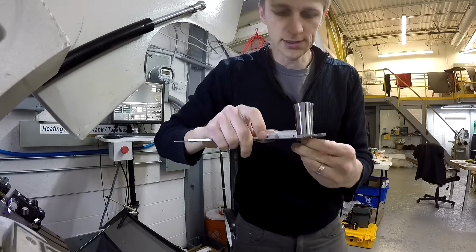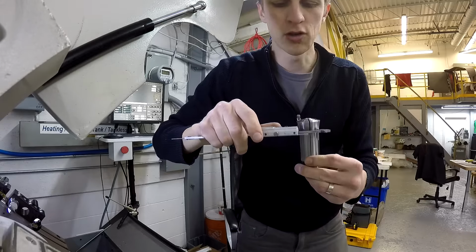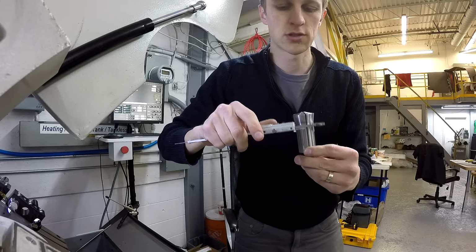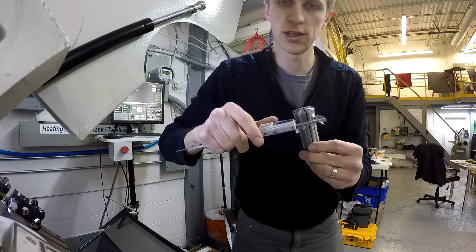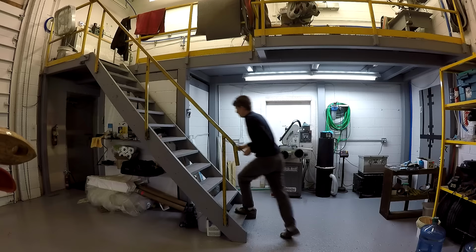Mitutoyo says 1.2490, 1.2620. So we are about 12 or 13 thou, I think, big? That's okay. Let's go grind it.